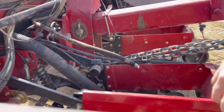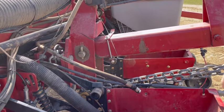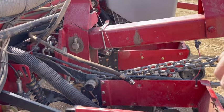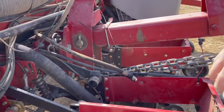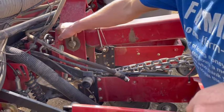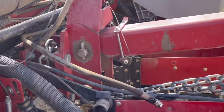Trying to push this forward so the front was pushed tight, but it was cracked. So yeah, I don't know if I have to weld that first and then try to pull it down, or just actually a little bit of a gap might be good for welding because you can get the weld to sink in deeper. Right.